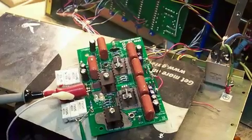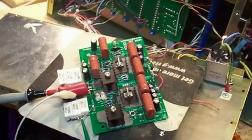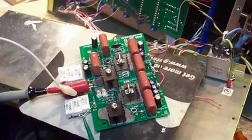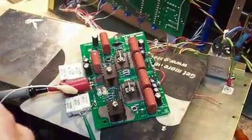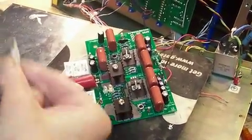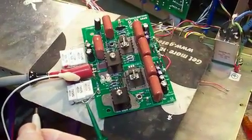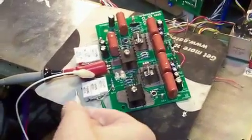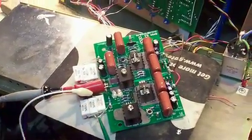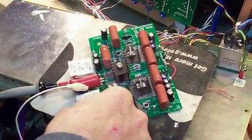Let me keep an eye on the voltage here for a moment, which is sitting at 15.01. Now we're going to demonstrate one of the great virtues of the LM317, which is its ability to recover from a short. I'm going to put this piece of clip lead on, and it may result in some plastic vaporization. Wait a minute, I have to get a grip on it. Okay, this clip lead may or may not hold the short circuit current.